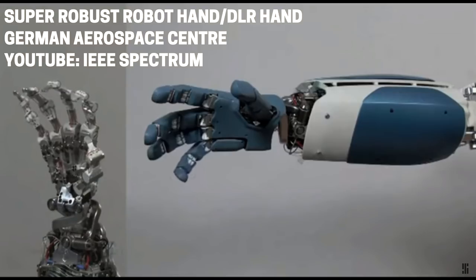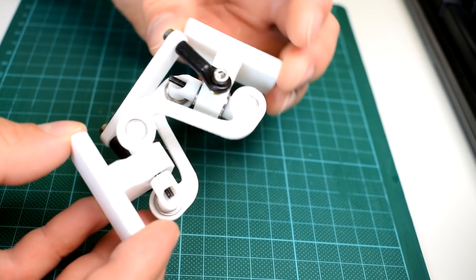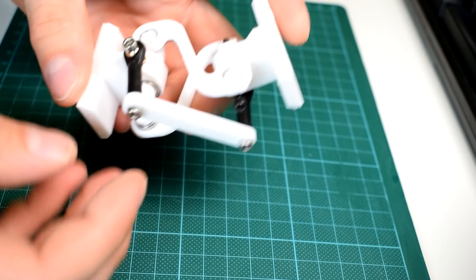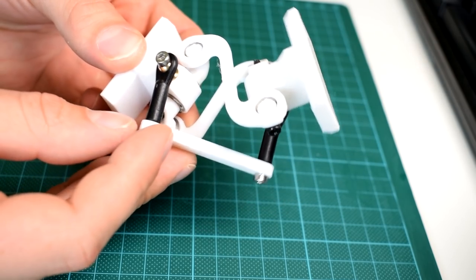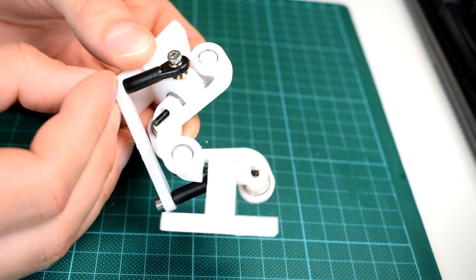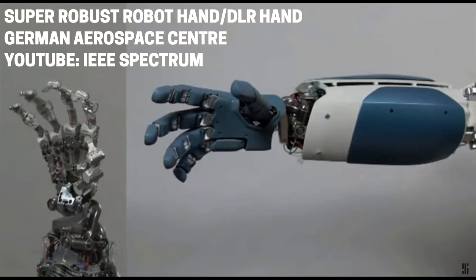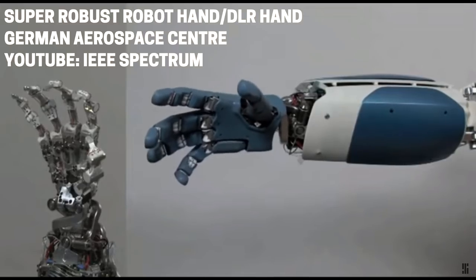My first impressions of that mechanism and my brief experimentation with this very quick mechanical mock-up leads me to think that the DLR spherical anti-parallelogram mechanism satisfies the condyloid joint requirements of acting with a wide roll laterally and a small roll in flexion/extension. I really like the design of it, but I also think that the DLR hand and particularly its forearm is much bigger than a human's. In my design I'm going for a more standard human form factor.